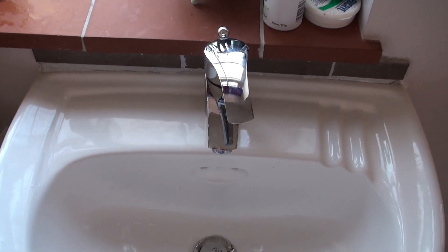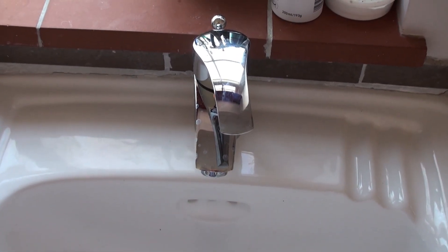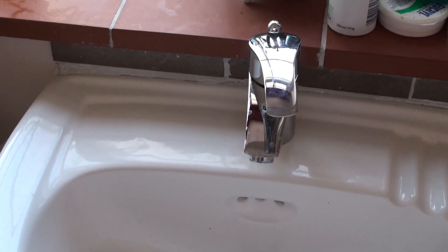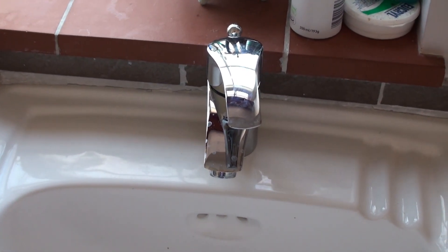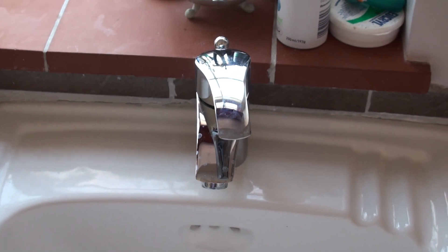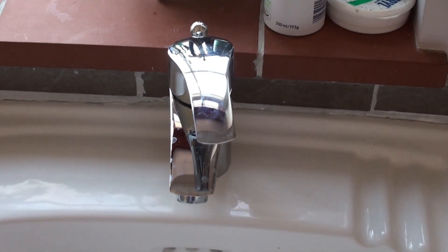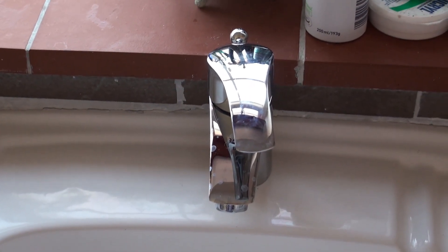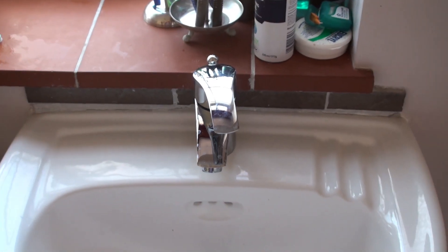So we're going to stick with the Grohe part with the green filter removed, and that's the flow you get from eight feet of head. When I was ordering these taps online, suppliers and various people on Amazon and eBay were claiming them to be low pressure — they weren't. Minimum pressure was one bar, which would just give a trickle in this situation. Some are rated at 0.2 bar and these are rated at 0.1 bar, and that's the sort of flow rate you get. If you're buying taps and have a conventional reservoir tank in the loft on gravity feed, you might find that interesting — I couldn't find any resources which actually showed them working. Subscribe and see all sorts of other hands-on fitting experiences I put on the internet so people can learn from my experience.